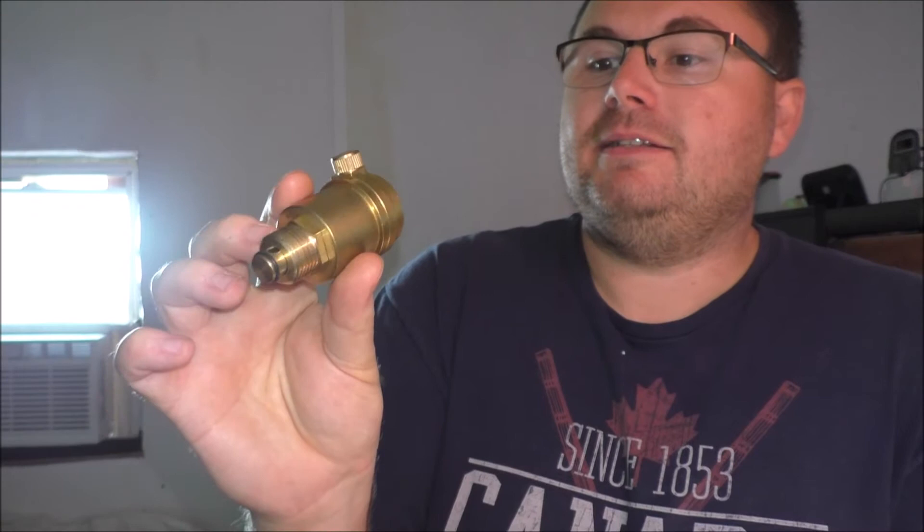If you watched back where I was experimenting on my Cubic Mini wood stove making a DIY boiler system, I used a tiny USB pump which worked really well — I was impressed with it. But when air gets into the rotors of the pump, the pump can't pump. So this is why I bought this — it's a boiler system air remover. It goes in-line at the highest point of the system, near where you fill the system, and it will automatically get rid of air without me doing anything.